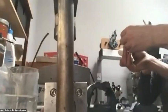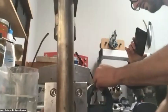Okay. So what's sort of important when you do a burn-in tang is that you put wet paper on the blade. You have to check where the cutting edge is on the top. What did you say? I was just going to say that it's really ideal to use a metal vise if you can, because it helps with the heat absorption and stops the heat transferring into the blade as well. Absolutely.